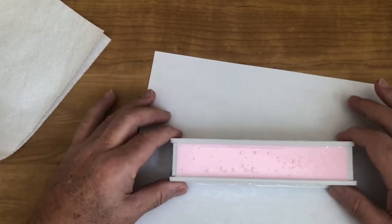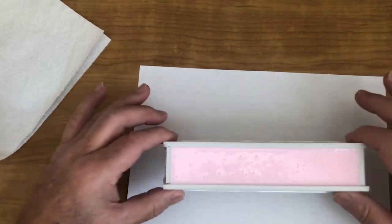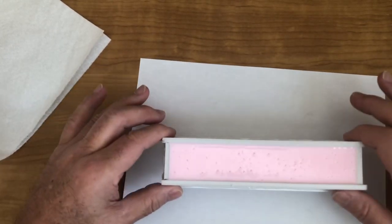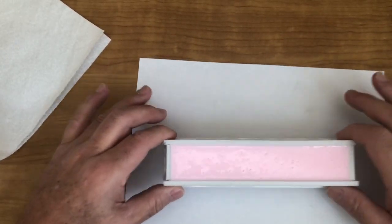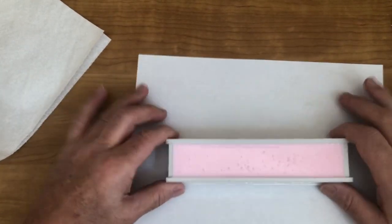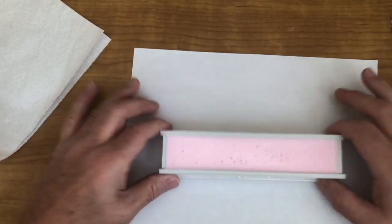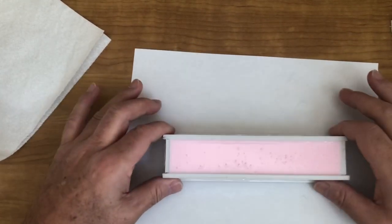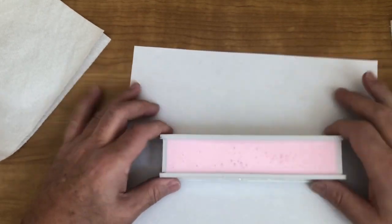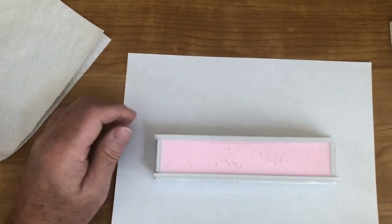Holding it up and pouring it in a thin stream about 6 inches up from your mold allows less air in. Or if you want to invest in building yourself a little vacuum pot, you can set it down in there and pull a vacuum on it, and it'll pull all the air out, and you won't get one bubble in there. So, anywho.